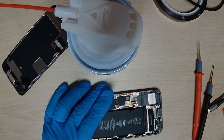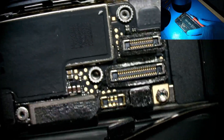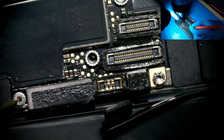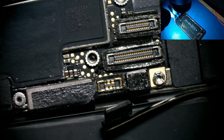Let's go to the microscope to see much clearer. That's our battery connector. We have positive on ground and ground on the test — better connection. We get 0.75 volt, that's fine. 0.7 volt — that's fine as well.